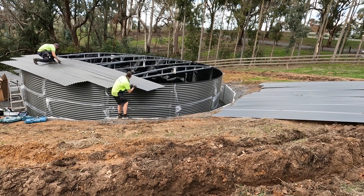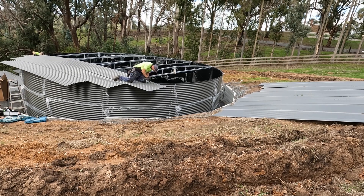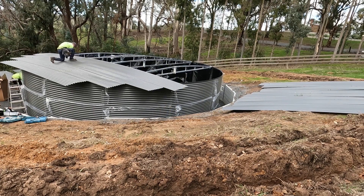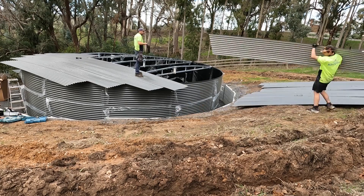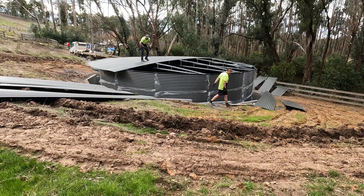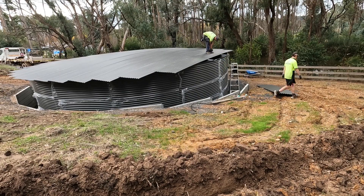The roof goes on — it's quite good. The trusses are strong enough to hold that roof up and one person. Ideally it would have been nice to have a fifth truss but this is more than adequate. They progressively go around and install the roof, and once it's all on they measure out the circumference and cut around the edge to create a small overhang of probably two to three inches.